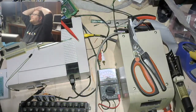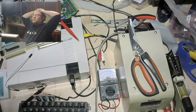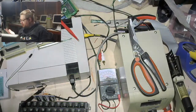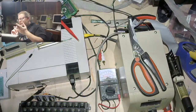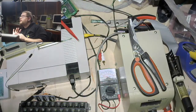So I have some ideas for Sega Genesis to solder a bunch of serial I2C memory to just get joystick port 2 and make it like an SSD. Load and save some pictures and maybe some music, but this is just an idea. Yeah, that should totally work. The Genesis's controller ports are super duper flexible. They're basically GPIO ports. They also each can be a slowish speed but still usable serial port. There's like three modes: serial, GPIO, and some other mode that does a weird thing. But you can bit bang it as GPIO, and you can connect I2C crap to it all day.